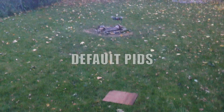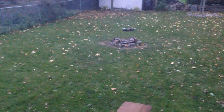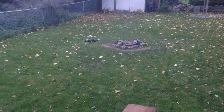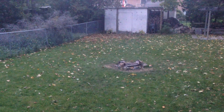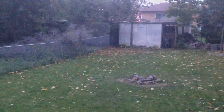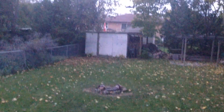I was hoping to get some sweet footage showing the difference between the default and the OpTune PIDs, but it's kind of hard to demonstrate on a pretty windy day — you can see a few wobbles here and there, but for the most part the default PIDs are okay. My original complaint was when I had a GoPro on it, and that brings up a good point: if you have a GoPro or different sized batteries you're interchanging, it makes sense to have different PIDs on settings banks that you can switch between easily. One good way to test your PIDs is to do a rapid descent — that will typically wobble if the PIDs aren't good. With the OpTune PIDs it's much more locked in, very little interference from the wind. Rock solid. Very happy with the OpTune PIDs, and I'll continue to play around with them. Thanks for watching.